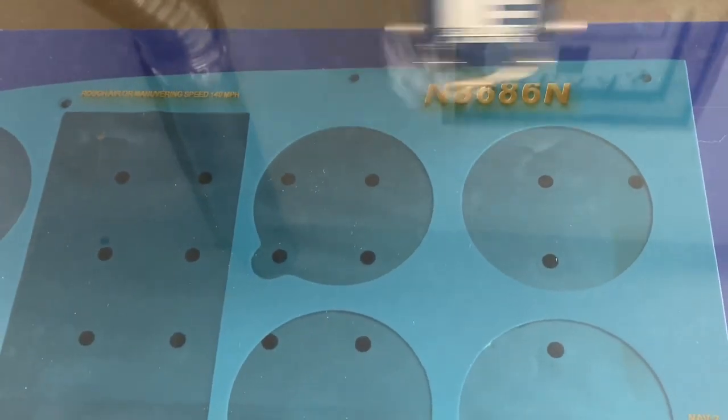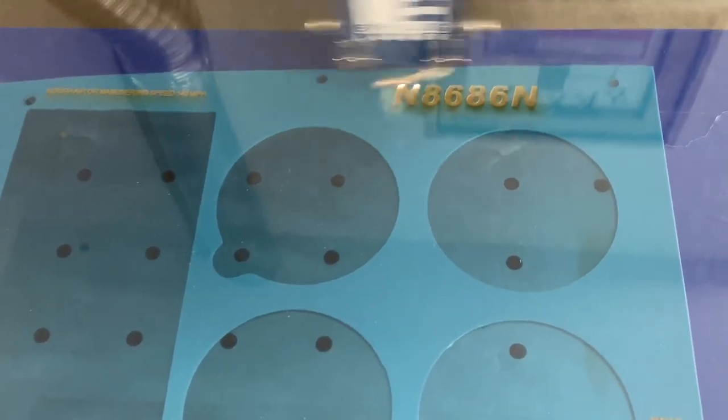From there, we take it over to the laser and we're going to engrave through the stencil. The engraving varies on powder coating — when you send a job out, make sure you send a little square panel to go with it that you can test on, or powder coat both sides of your panel and test the backside. Powder coating is very funny — sometimes it's hard, and you've got to get the power settings just right. If you burn too hot, it really melts out and looks like crap. You want to find the right power settings so that when you engrave it, it's really sharp and not melted or puddled.